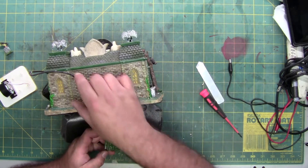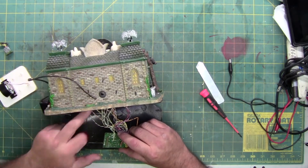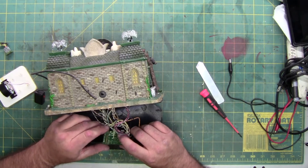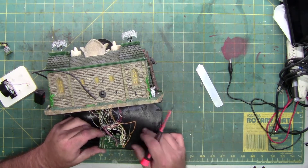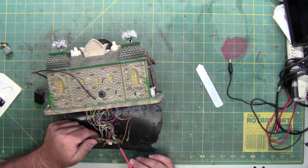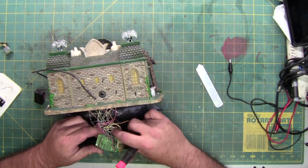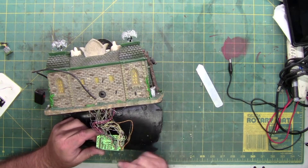So that's all five: these three plus this one, and then the one that goes to the power port. If you have a problem with this switch not working, those are your five soldered points. If you can turn this on then your power one is probably still soldered pretty good, but if you lose or wiggle it, it's probably right here or the wires inside the switch itself have come loose — unfortunately pretty common. This bottom corner on the other side says GD.